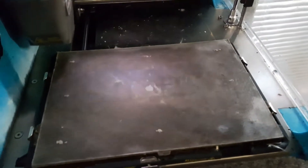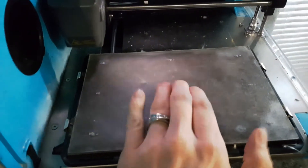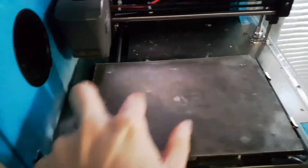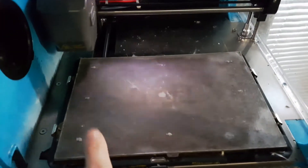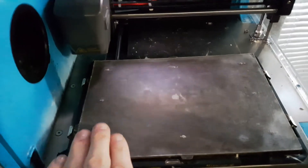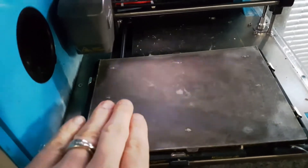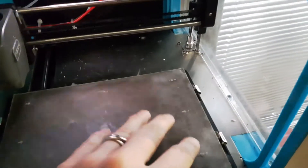You get bounce in the middle, and if you're using long prints especially at a diagonal where you need the full length of the bed, and it's ABS, the bed starts to turn up at the corners. Your model might stay stuck to the actual bed but the bed itself peels up and causes all sorts of problems and warps in your model.